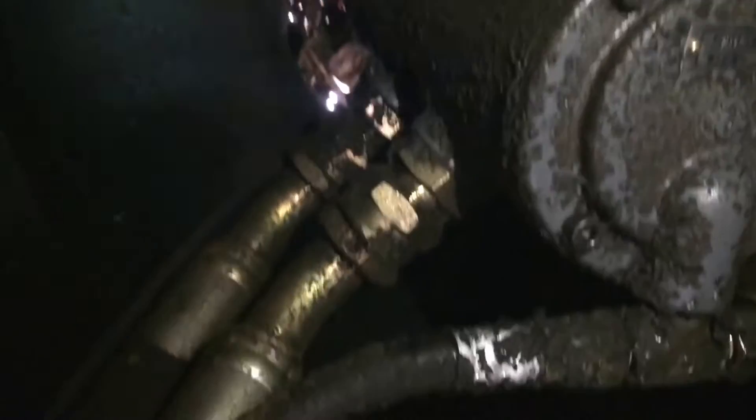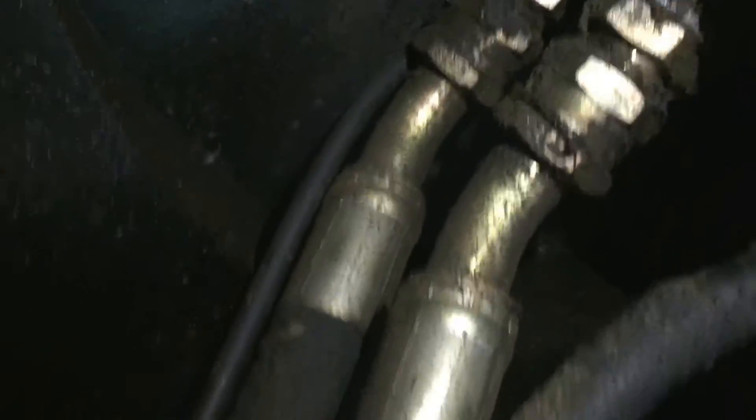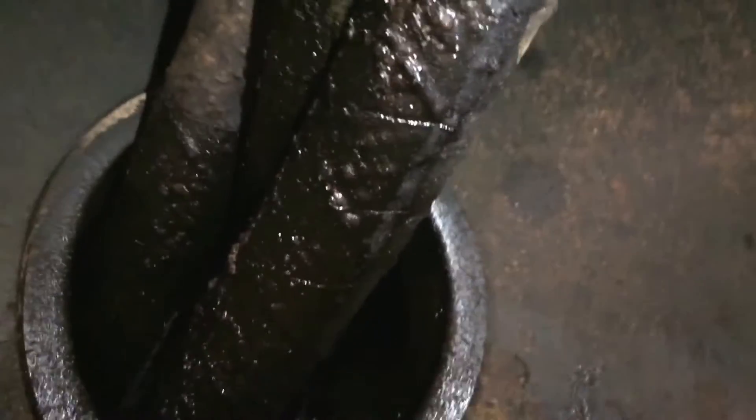This is kind of cool — looking up inside the belly of the beast. I've got two big hydraulic lines and what looks like a smaller hydraulic line, and I'm not sure if that top little one is a line or a wire. I don't know which one of these three is leaking. It doesn't look like they're leaking at the motor — looks like they ruptured somewhere down inside the tube. You can see daylight coming through from the other end where I took that other door panel off, so it's one of these three hoses.